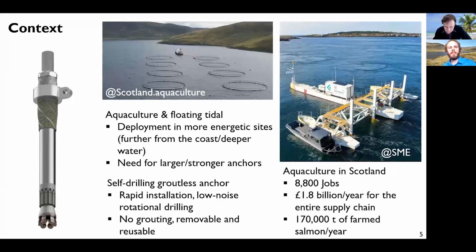The problem for the load test that exists in the field is that usually they are grouted anchors first, and you don't have much information on the real failure mechanism. What people did in the past usually was, they measured the force, the capacity, and then they thought, oh yeah, we imagine we have this sort of wedge failure mechanism, and we know the angle, and then they deduced a stress along the failure mechanism. But actually you don't have any real information on what's going on really.